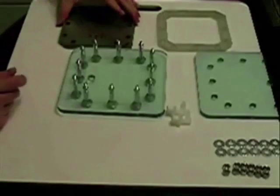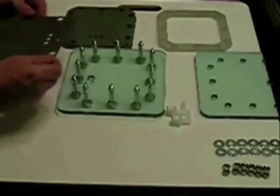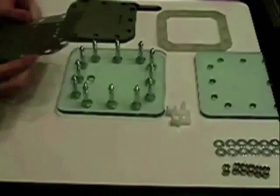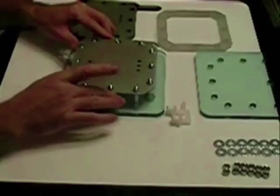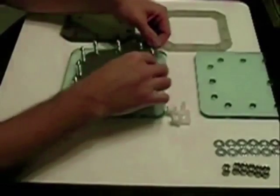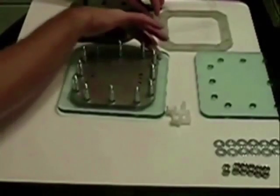The first few gaskets you put on usually don't go on that easy. Keeping in mind that the port hole is at the bottom on this one. You normally wear gloves, but make sure you've got clean hands. Put your first plate in place — here comes the fun part getting it to drop. Once you do, notice the tab — the connection is on this side.